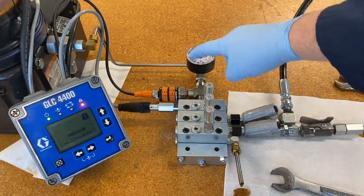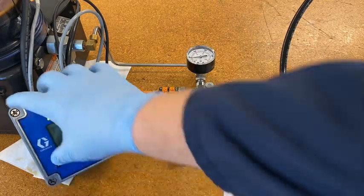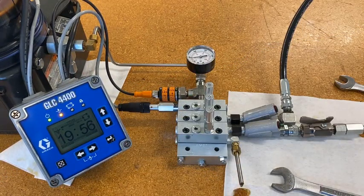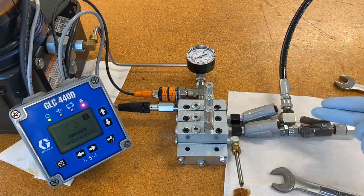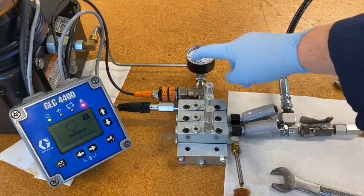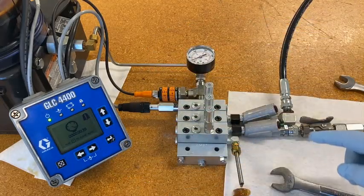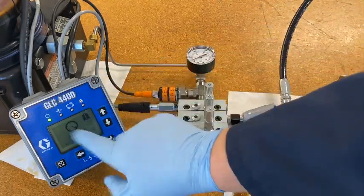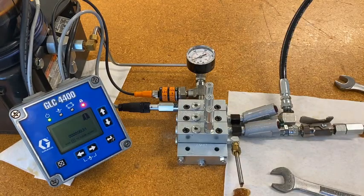You get your visual indication here, and then your pressure switch detects that spike — it's only momentary, you can see the gauge has already dropped back down. Let's do a third time to see this once more. You can see the gauge bounce around — there we go, we got a pressure spike and the system went to fault. Even as that happened, the grease still flowed through and it changed over to the next outlet, which is why the pressure relieved. That's the big key: with electronic indication, you get your visual here, but you're not going to get it on your pressure gauge — you're going to get it on your switch that sent the signal to the controller. Now let's fix it and run it one last time.